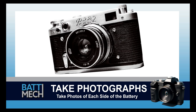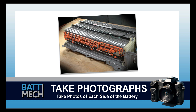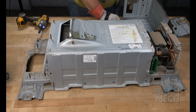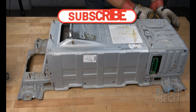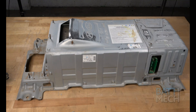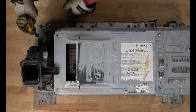Now's a good time to take a photograph of each side of the battery. These photographs can be used for review of assembly if you experience issues, and may save you from having to uninstall the entire battery later. Now that the work inside the case is finished, you'll put the metal case back on using the nuts and screws. Be sure to reattach all three of the metal case covers. Finally, you'll finish by reattaching the fan to the battery case.